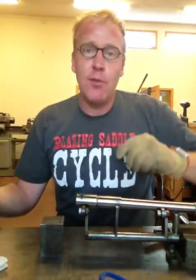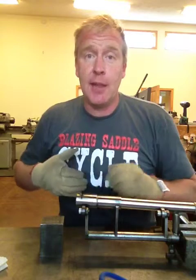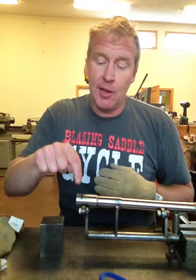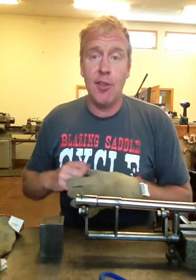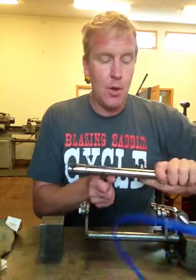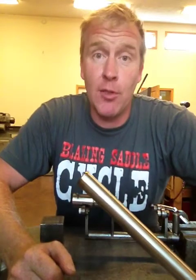Hopefully what we'll have when we take this out of here is a weld zone that is completely clear of any discoloration. We typically have just a little bit of discoloration on the very middle of the cap where it presses up against the inside support — it tends to retain heat there. And we'll just rotate this thing out of here. What we have is a nice, clean weld bead edge. A little bit of discoloration there on the end, which we'll clean up, but it's important that it's away from the weld zone, so it won't be an issue for us.